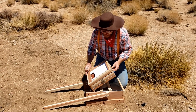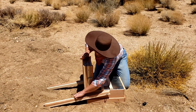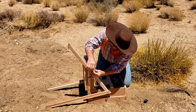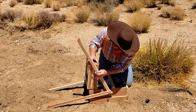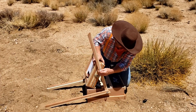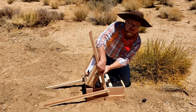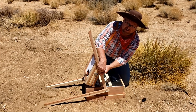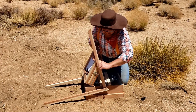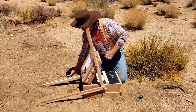Now we're going to take the box and simply tip it straight up. Then we take the inner leg and bring it all the way up, put one of the eye bolts around the half spear, bring it right up into here, and insert it into the corresponding hole. This whole thing just fits right in there — all you do is screw it in. You do that to all four legs. He's made this so it's really simple; there's not a lot to do except run the screws in. He's also got a little backstop so you can only run it in so far.